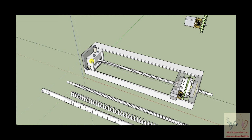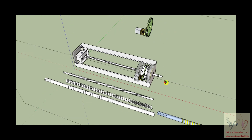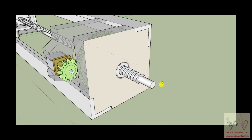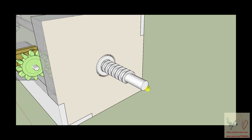And of course, the strength of this device, its ability to move an object, is related to the compression and tension strength of this ball shaft. And that involves, you have to go out there and get the tensile strength. So this is 0.2. It's a little less than a quarter of an inch. A quarter inch of alloy steel, that's pretty strong with respect to compression or tension.